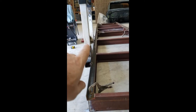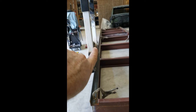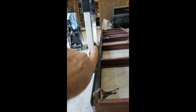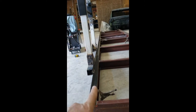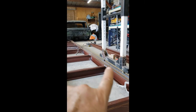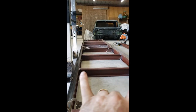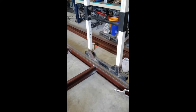I did realize that when this cradle was built and welded up, it did kind of pigeon-toe just a little bit. So instead of putting the wheels on there square to the legs, I went ahead and stuck the whole assembly up there and then squared the wheels up with the actual track on both sides. That way it will go ahead and roll, and I will try to show you that.